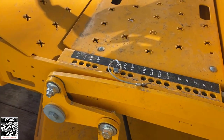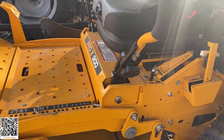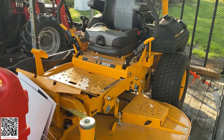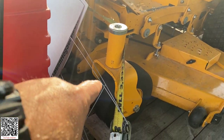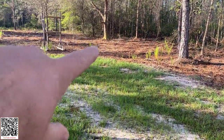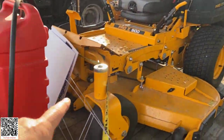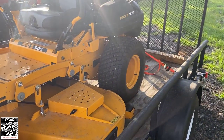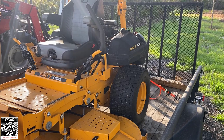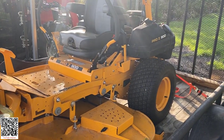By moving the lights up, my theory is the light will come down from above, and a hat or helmet will block more of it. Overall I'm highly impressed with this mower — little details like the screws that hold things down, super easy for cleaning underneath, the seat has an air ride adjustment. Top-of-the-line mower at a top-of-the-line price. The front tires are solid — the rental mower we used to get started kept getting flat tires in the front. In these areas, fire stubs left in the ground become tire puncture hazards. For the rear I'm going to drain the air and put a Kevlar fiber product in — when the tire gets a small hole the Kevlar fibers blow into the hole and keep it from deflating.